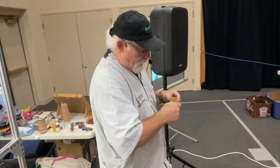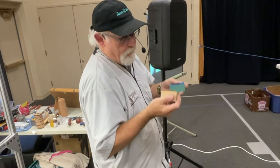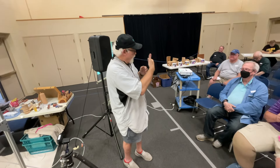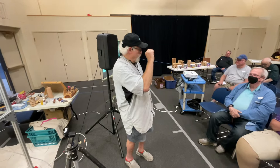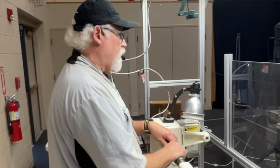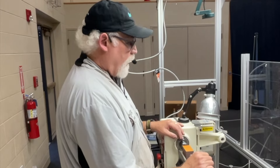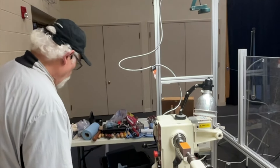If the insert is proud, you'll either have a gap between the stopper and the wood, or you'll have to sand it flush — but you don't want to shorten that tube. I usually push it against the belt sander gently, just to get the surface flush. You want that middle three-quarters of an inch as flat as possible. Once the blank is drilled, epoxy cured, and surface prepped, that's really going to be this side — the other side I'm not worried about, because that's going to be the top of the mushroom.